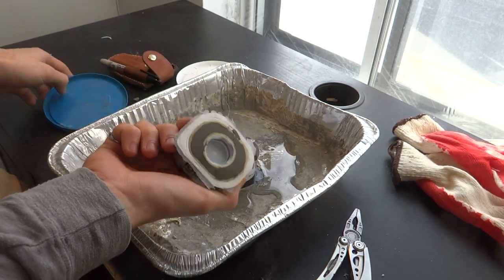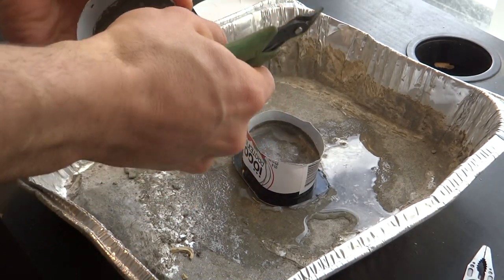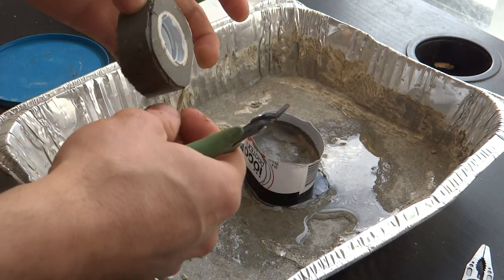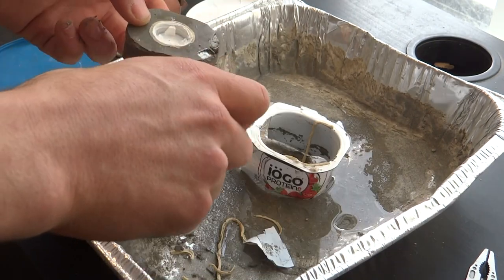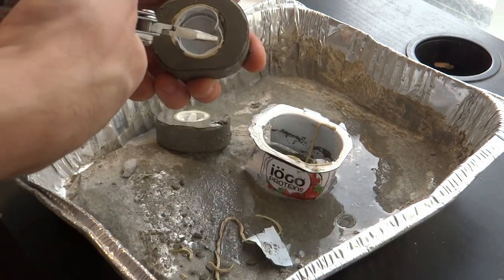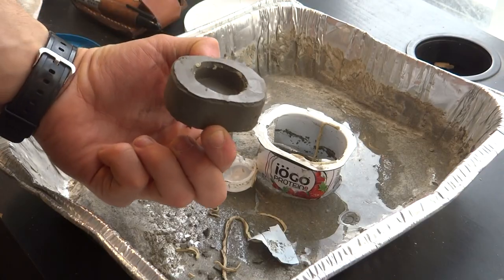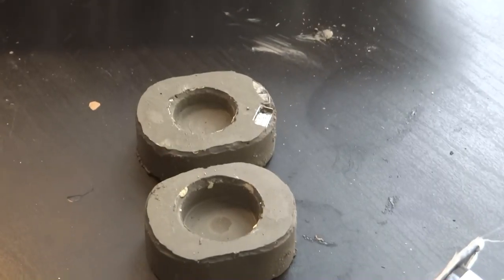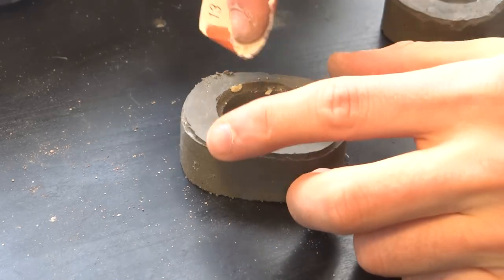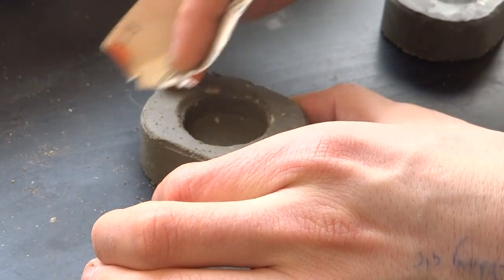In the end, I was lucky to have made two molds because, as you'll see by the exposed staples, one of the castings failed. It looks like the staples made a little cave in the mold that the concrete was unable to enter. I think if I were to redo this project, I would cast a very thin layer of concrete on the bottom of the molds before adding the staples. I sanded some of the rougher edges of the successful casting while the concrete was still wet and a bit soft.